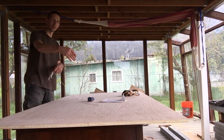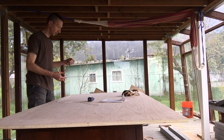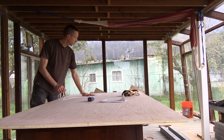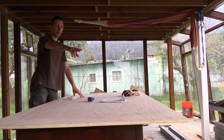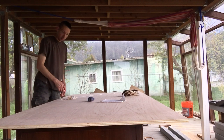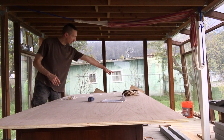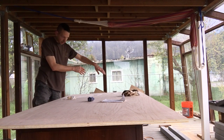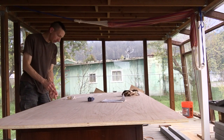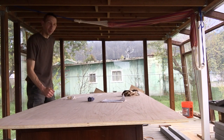So I didn't have a 65-inch compass — or is it a protractor? A 65-inch compass basically, I think that's what we're working on. I knew the 92 dimension for the length, so I measured out to 92. I got one arc at 65 inches from that point. Then I took the string, locked it down at the 92 and a half inch mark, measured out 65 inches to a reference point, held the string, pulled it tight, held the pencil there, went along the arc, and got my point.